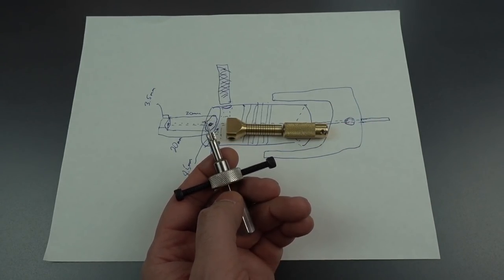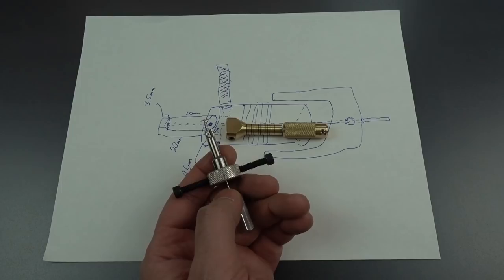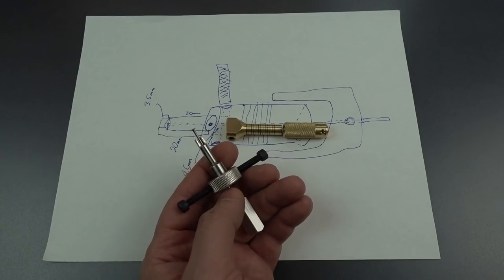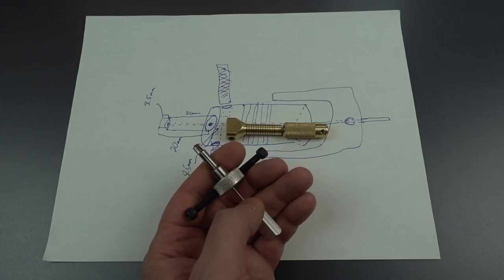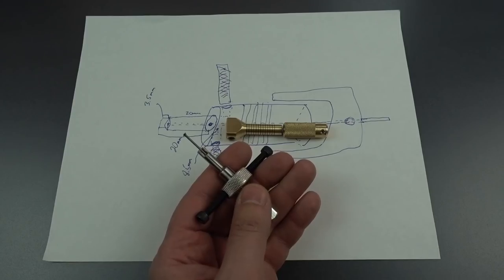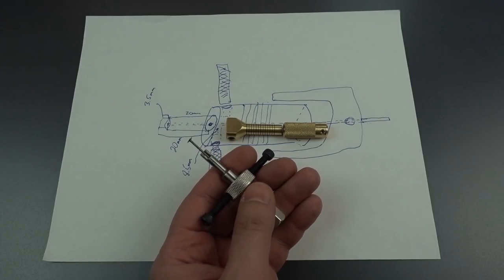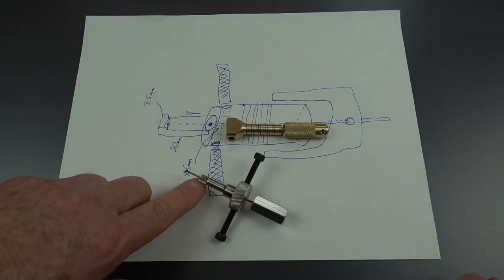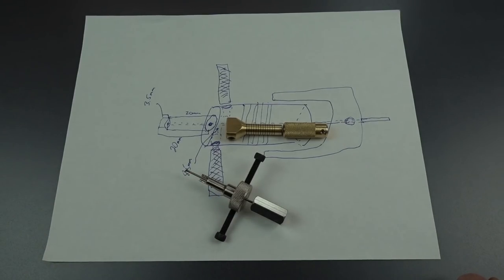So what I was thinking is we can make this out of tool steel. I have some downstairs that is annealed. We can do all of our machining and then harden it. How's that sound, Bill? That sounds good to me. I've had a lot of failures with stainless steel. You think it's as tough as woodpecker lips, but when you start making these thin little prongs and applying torque to them, they tend to bend and break fairly easily. So I think tool steel is the perfect choice.